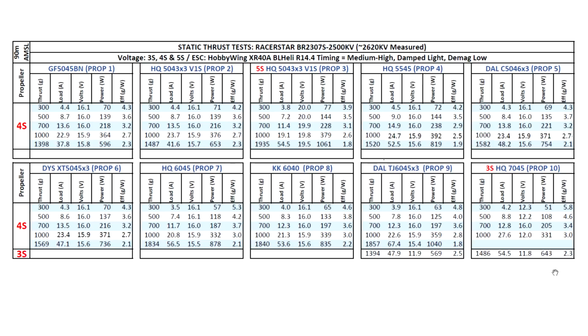So overall, pretty decent motor. As you can see, pretty decent performance. So this should be a good option for using it with the heavier props. I don't think it makes sense to use it with a 5-inch prop because of the weight of the motor. There's better options. So maybe with 6 and 7-inch props, this motor would match better.